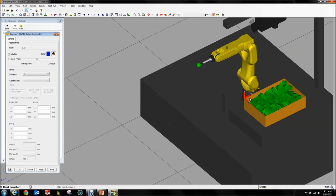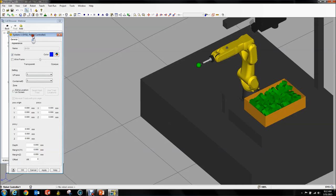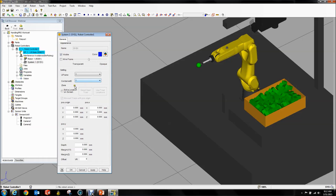You want to select your user frame — we're going to do this relative to User Frame 1 because that's the one we have relative to our bin. You get two Bin IDs — these are global variables. If I set up Bin 1 and create a new system and select Bin 1, it'll pull in all those data values. So the container values are tied to the container ID, not to the system you're setting up.